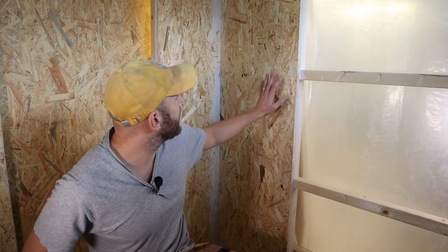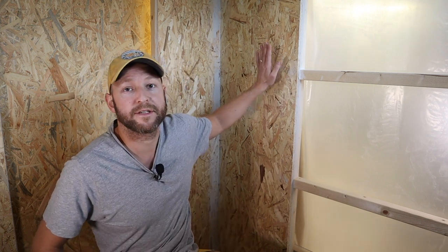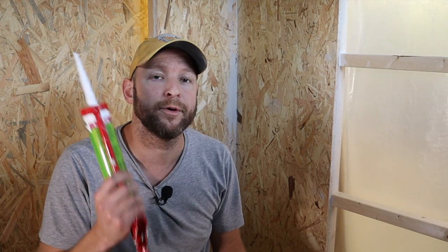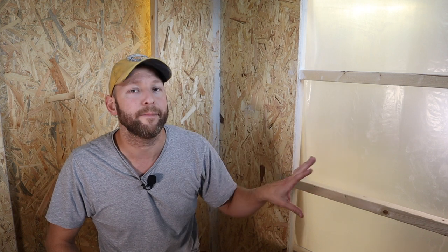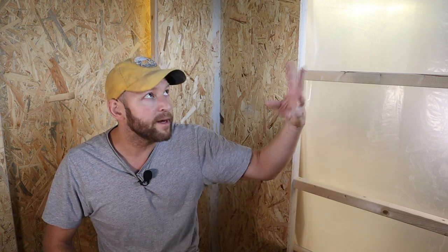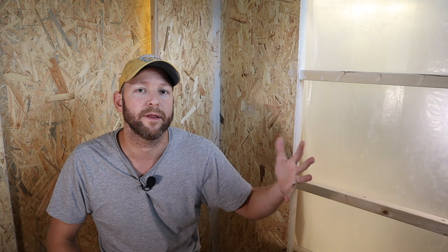The walls and door are in place and I have also leveled out any uneven surfaces with putty. Next up is to seal up the booth, because this will be an under-pressure booth. The fan will drag all the air into the booth from the outside, and I want all the air to come through the filtered intake. If I don't seal it up perfectly, air will come in from any other hole or gap, dragging in contaminations and dust — and we don't want that.